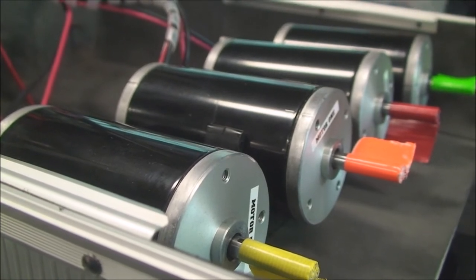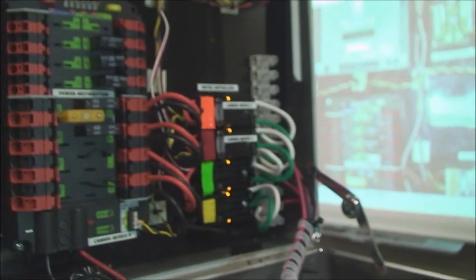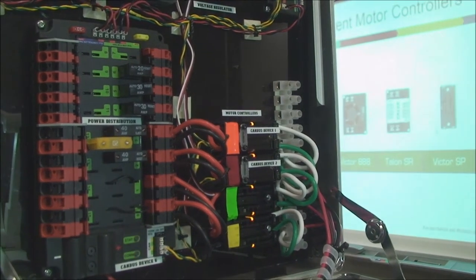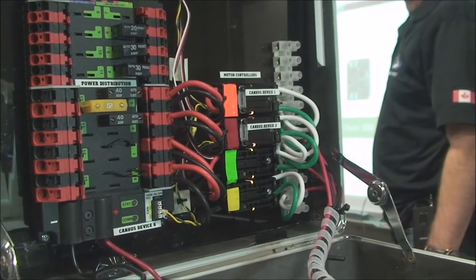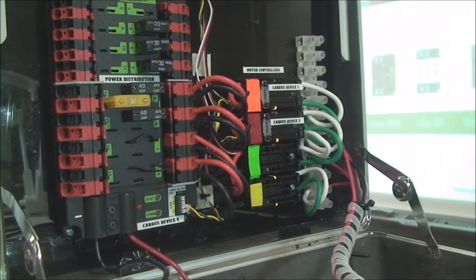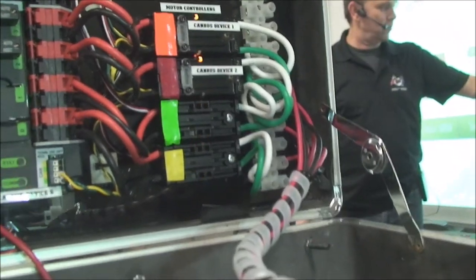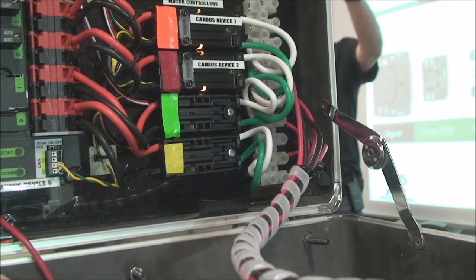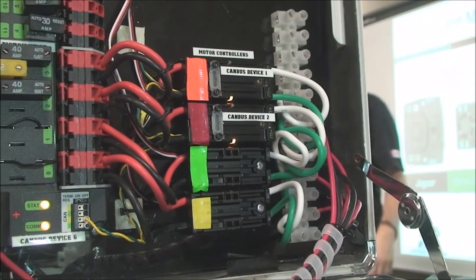So most motor controllers, Talons and Jaguars and all those guys, use pulse width modulation for information. But nowadays they also have the new Talons coming out, this Talon SRX, and this Talon SRX has got CAN bus, right? Which means you simply take the CAN bus signal and daisy chain them all together, so one connects to the other, connects to the other, just like Christmas lights, right? And then the last end of the CAN bus goes to the CAN bus controller on the roboRIO.